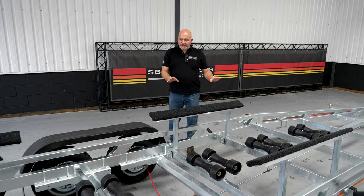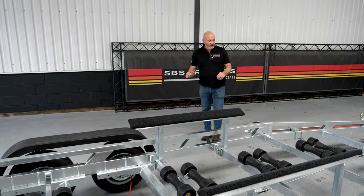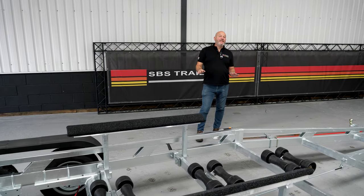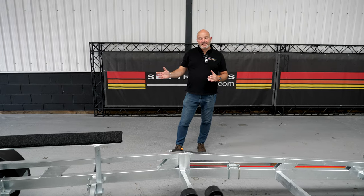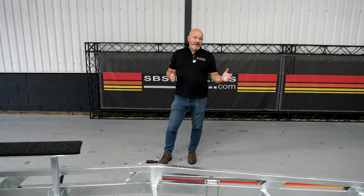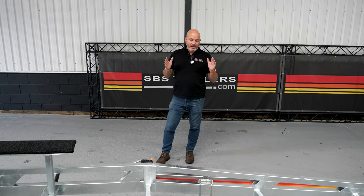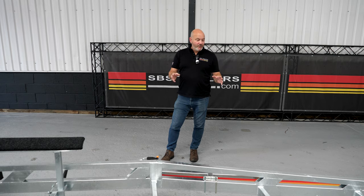You've got fully adjustable bunk supports all around, but what we really wanted to show you on this trailer — particularly with this type of semi-displacement boat — is that you do have to get in quite deep with the trailer to float it off. So unless you want to wear a snorkel and flippers in the car, you might need to consider an extension or a launching pole, and we've got one here.